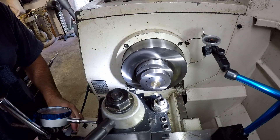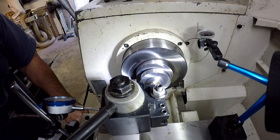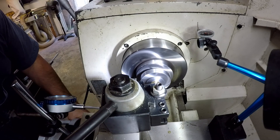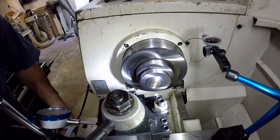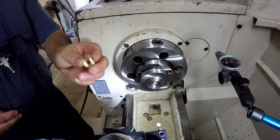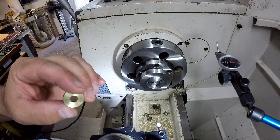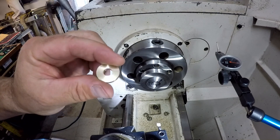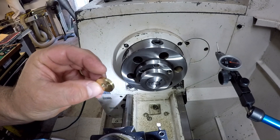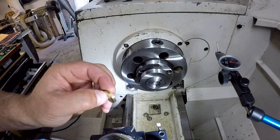Backing out to zero, hand-feeding it in — indicator on top reads zero, back to low. That should be it. For those who have done this type of work before, it's a pretty simple but repeatable setup. Right now I'm holding about half a thousandth on the diameter, which is plenty. It's slightly oversized because it still gets a couple of through holes for thread studs.